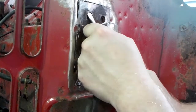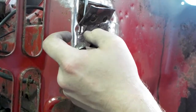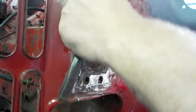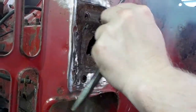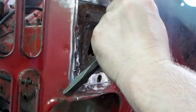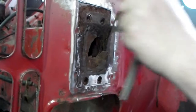As you can see, all I've done is cut through the first skin. Now I'm carefully teasing it off and breaking it where I haven't gone all the way through. You're better off just breaking it off rather than cutting too far in — it takes a little bit longer but you know it's going to be strong later on.